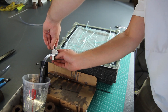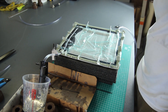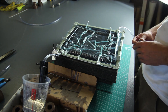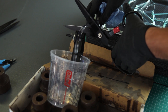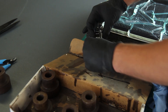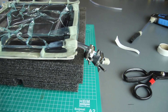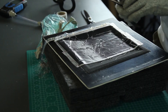I'm using the IN2 infusion resin with a fast and slow hardener mixed into it. During infusion, I throttle with a clamp to make sure the infusion isn't going too fast, as this is a main cause of pinholes — the resin travels over the top layers but not at the same speed on the mold-side layers, trapping air. At the end I close it with two clamps to make sure there's no leak on the clamp — I've had that problem before, so now I always use two. Everything cures overnight in full vacuum so no air enters the part, which would cause finish problems.